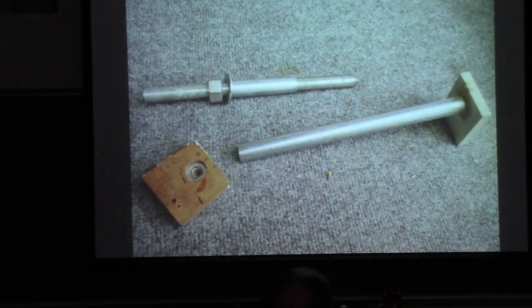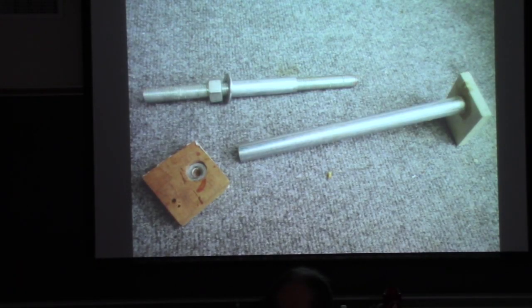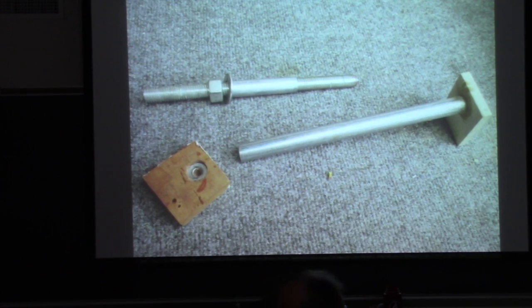That's just a reminder. Okay, so when you have a fingerboard extension that has cracked on either side and the neck is really pulling into the body, you've got those big splits coming into the rosette, you want to glue it, but first you want to try and realign everything to get that heel block and that extension back into place. So this is a tool that I made. I call it a spreader. I think they had one at the Martin factory, I don't know if it was like this, but this was my version. That's just EMT, electrical metallic tubing, threaded rod, nut, and then just a couple of wooden blocks.